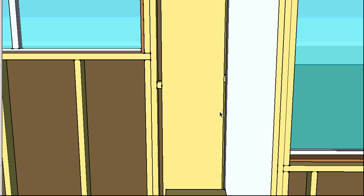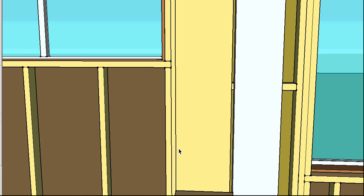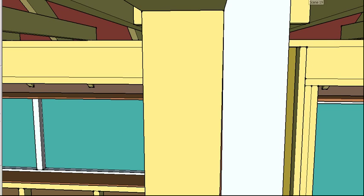You need to pack this area out. What I used to use was strips of 3mm melamine, and you just put one layer on at a time and feather it out at the ends. So this particular bow, there's the back cut off, so I've planed the back off there. Still got the gap here. So there's 2 strips of the melamine, and you'll see they feather off at the top and similarly at the bottom. So what you do is just staple them on.